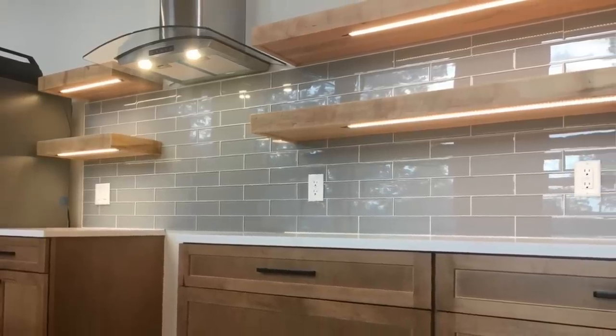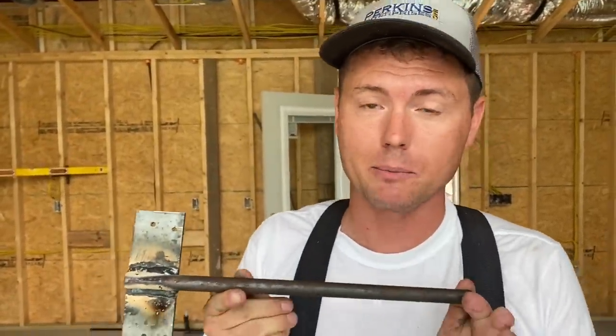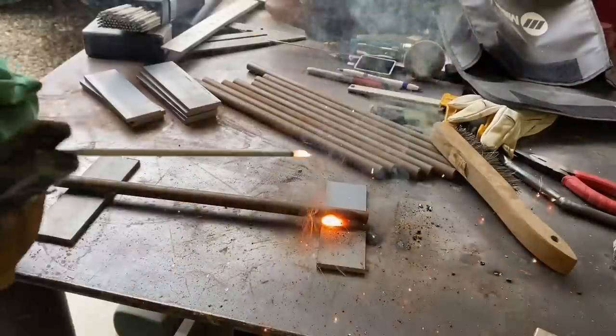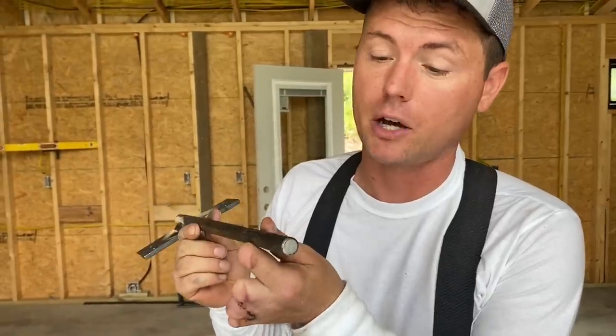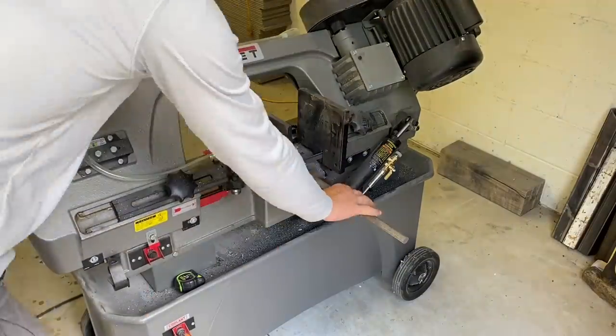This house has floating shelves instead of upper cabinets — zero upper cabinets, well maybe one over the fridge. We're using floating shelf brackets that we made at the shop. I've just been practicing my stick welding to fab these together. This is some quarter-inch thick by two-inch plate with a five-eighths diameter solid rod, which makes a very sturdy shelf.